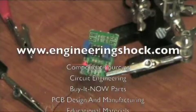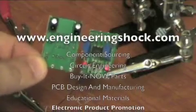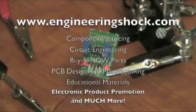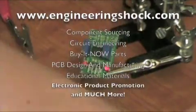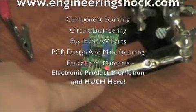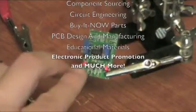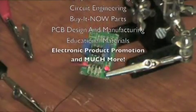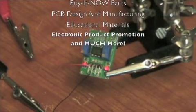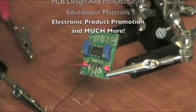It's very simple. What we've got - this is the back side - is two IR detectors that are completely adjustable up to about 3 inches each. Very easy to configure. 5 volts, ground on the right, and you've got two output pins. The output pins are set up so that you've actually got indicator LEDs on there. I've got my right set up to detect at about 3 inches and my left to detect at close range, so you can have two different levels of detection.